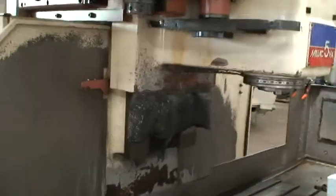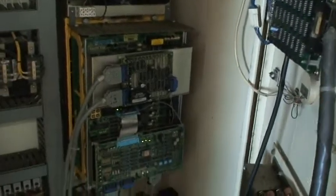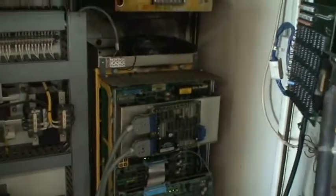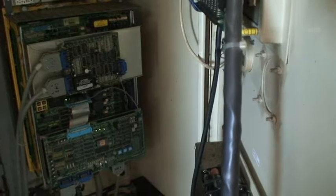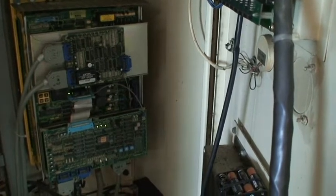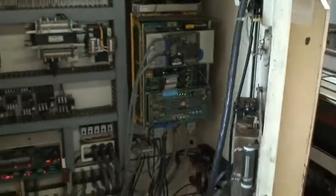A special feature about this machine is that in 1990 it was updated with a FANUC spindle drive system, including the motor and the drive. This is a 15 horsepower AC spindle motor system — it's a red cap motor — and the drive here is an A06B-0728-B180. That's in great running condition.